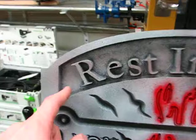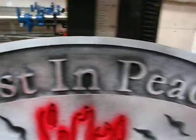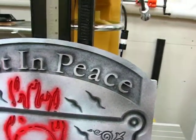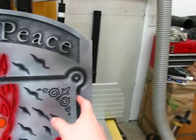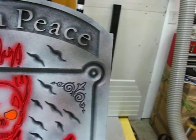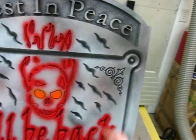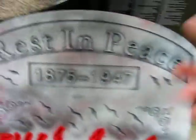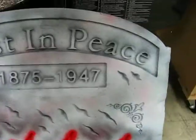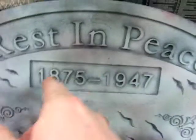Also, this pocket on this one — I cut it to 0.4 inches deep, and that's way deeper than it needs to be. I ended up making it only 200 thousandths deep on subsequent versions. The cracks here are the same depth, and I also shrunk those down. That first one was more the prototype; my subsequent versions only have those features at 200 thousandths deep.